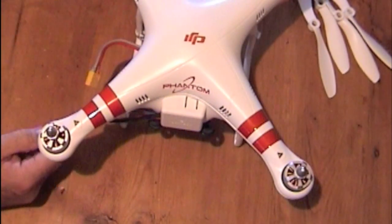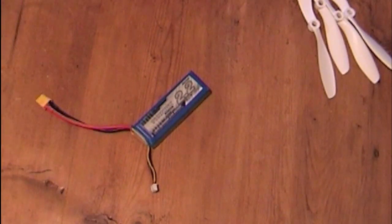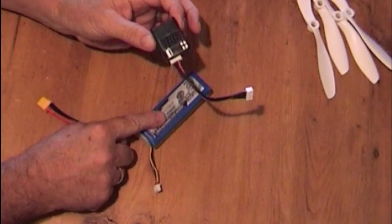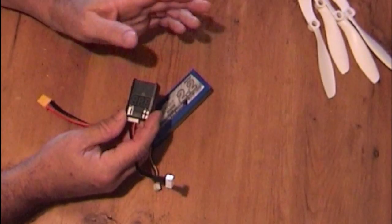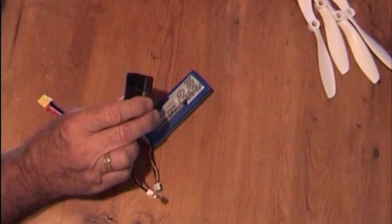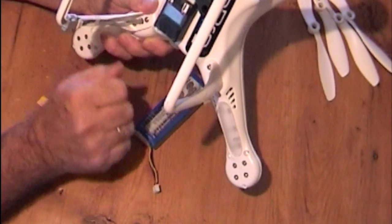There's another little modification I've done here which I thought you might be interested in, and this concerns the battery. There's your battery, and that's this little baby here. You'll love this because this makes a hell of a noise. The idea is it gives you a warning when the main battery is going to go flat. A lot of people say on YouTube you can't see the red light at the back flashing when your main battery is going down, particularly if you're high up or a long distance away. Now if you stick this underneath the quad, run your little cable through there, velcro it to the bottom — you can see it underneath.